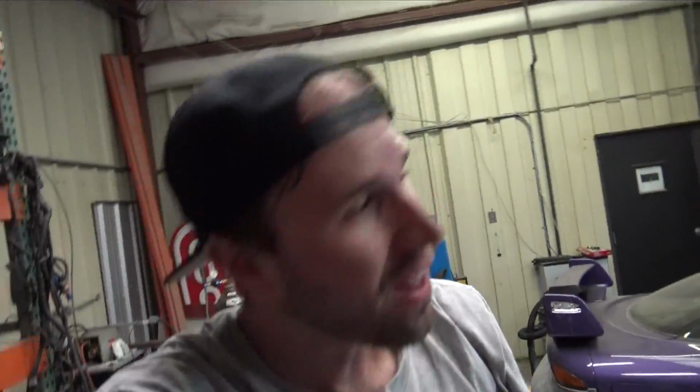So it's pretty hot in here, but I have gotten to this point where I'm just 100% fed up with front mount intercoolers or V-mount intercoolers. They're just really inefficient. Then you go from the intercooler to your intake manifold, your intake manifold, it's all hot. It's all getting heat soaked by the engine. So I'm going to resolve this issue. If you are on my Instagram, you pretty much already know what I'm talking about. I'm doing a CRV or a K-series intake manifold the same way.